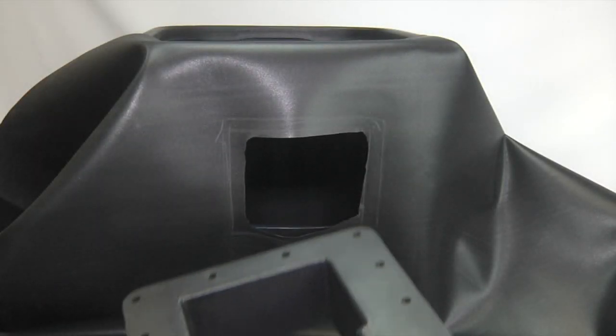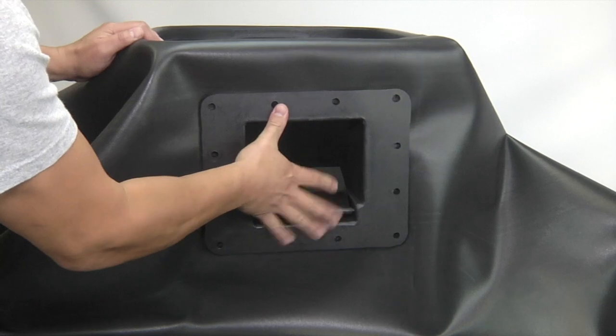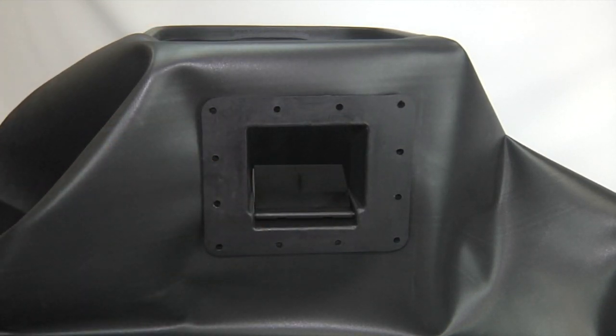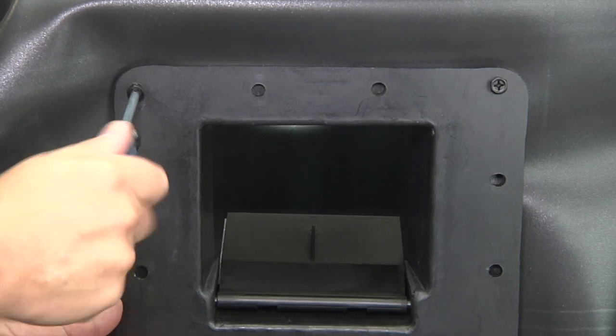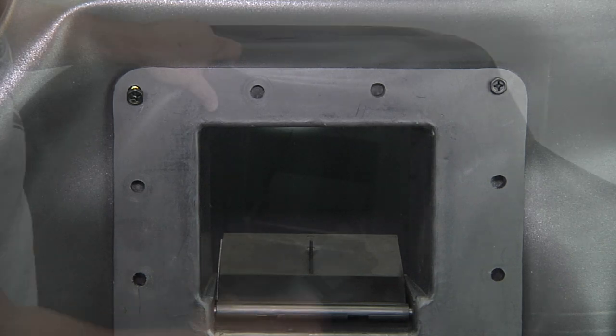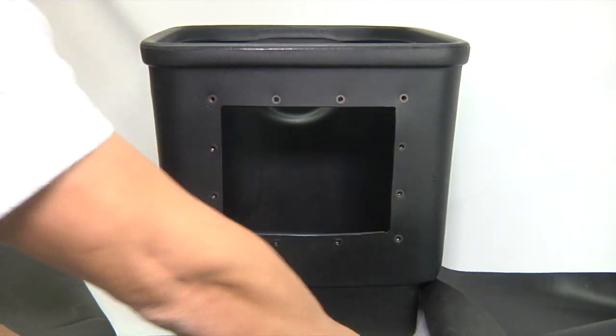Insert the skimmer faceplate through the cutout and stretch the liner firmly around the component, making sure that the holes from the skimmer weir door are at the bottom of the component when installed. Temporarily attach the liner to the front of the skimmer by lining up the top corner screws of the faceplate. Unthread the screws and pull back the liner to re-expose the skimmer opening.